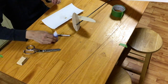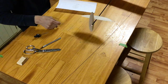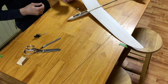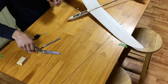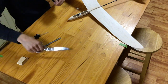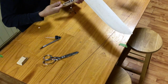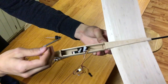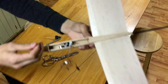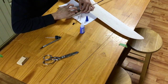Two limiters are actually not really necessary, but it's sort of an idealistic precaution which I figured I'd show in this tutorial. I'll now orient the airframe such that I can work with the front end of the thread. I'll then cut off that limiter, as I'm working with the thread now, so there's no chance of it accidentally slipping back through the tail boom. Then I'll wrap it twice around the outermost hole in the servo arm, as you can see I've done here. I'll now put down a paper towel, and use a little dab of CA glue to affix the thread to